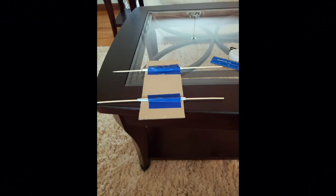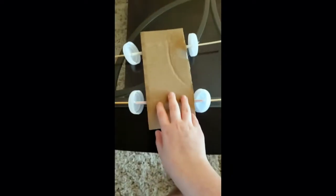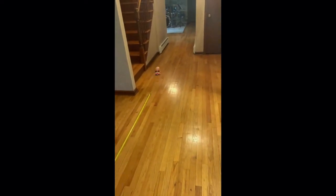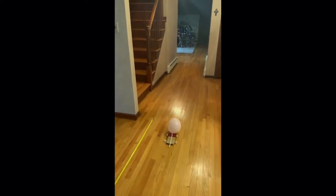This is a photo of how the axle — a skewer — was connected to the main body of the car. In actuality, the axle isn't connected; it's inside of a straw which is taped to the car. This is because if the axle was taped, it couldn't rotate. Here are two videos of the car rolling with the wheels attached to the axle. It is not the straightest, caused by the wheels turning on the axles. We fixed this problem by lowering the wheel size and changing the drill bit, which was a little too big and caused the wheel not to stay on the axle.